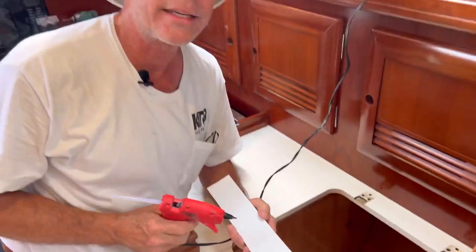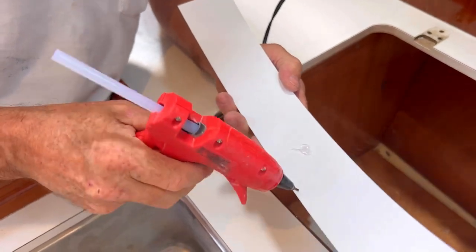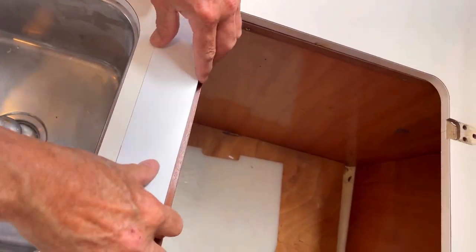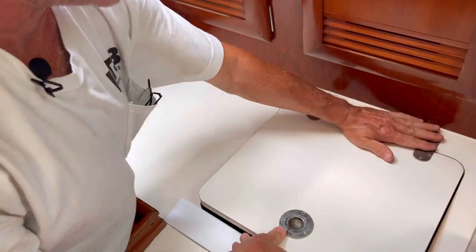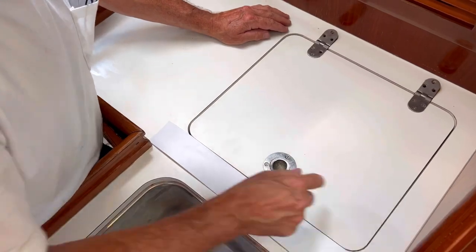It's just hot glue — it's temporary, it's not permanent. So we're going to hot glue this down in the middle. I like to do this because the spiderwebs come. I want to have it right on the edge. Notice I went past the line here so that our next piece can go down here. We do that all four edges. We want references to the edge of the opening. Our hatch is smaller than our opening — that's why. We have approximately a saw blade width all the way around this perimeter. So when we cut directly on the edge of our template, it's going to be a saw blade width, which then we'd be able to use what we cut out as the top to the hatch.